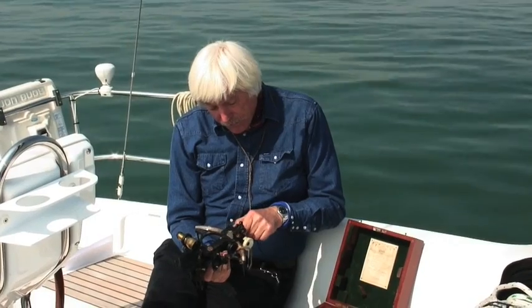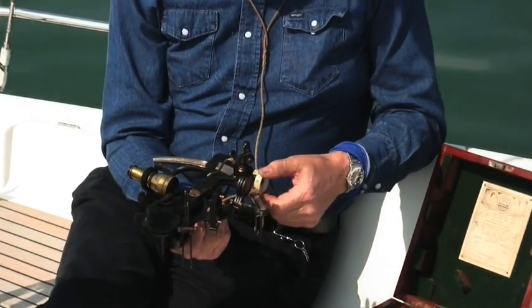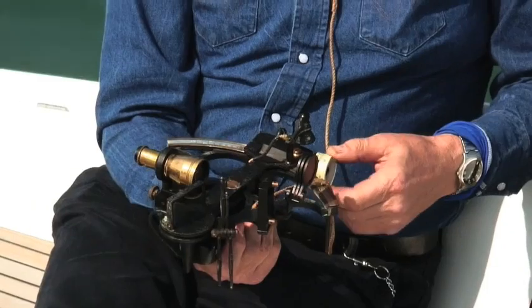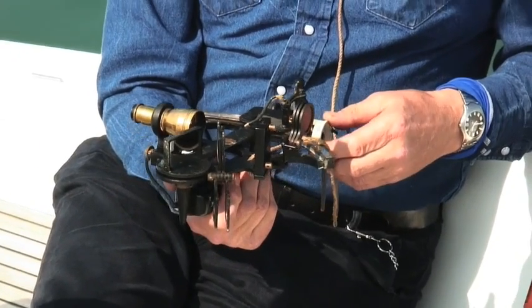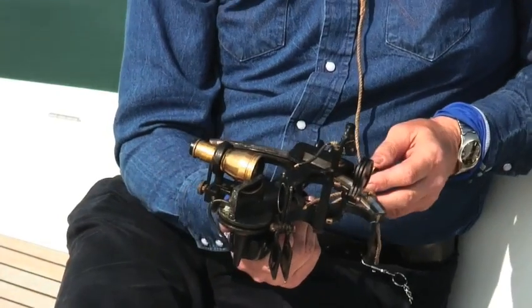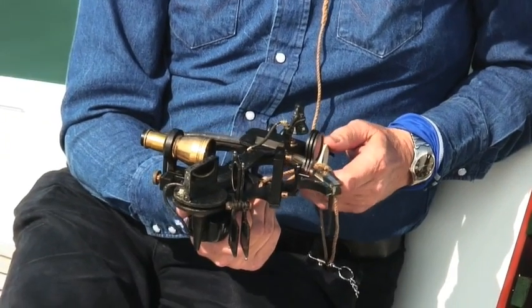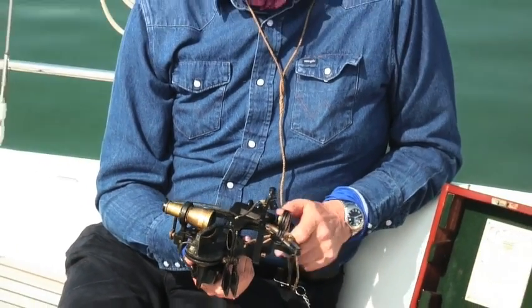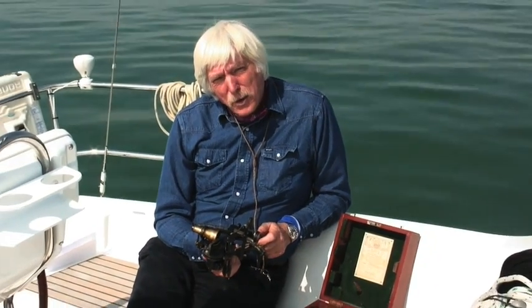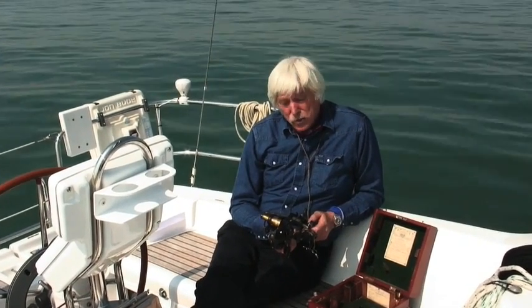As I move this around it's measuring angles — first of all to one degree, then a minute of a degree, which is a sixtieth of a degree, and then this little drum here breaks it down again, so just by looking at the subdivisions I can get it down to a tenth. So I can read angles to a subdivision of a tenth of a minute. Minutes equal miles, so a tenth of a minute is a tenth of a mile — one cable's length — measured with an instrument built essentially by the Victorians and not changed since. Remarkable, isn't it?